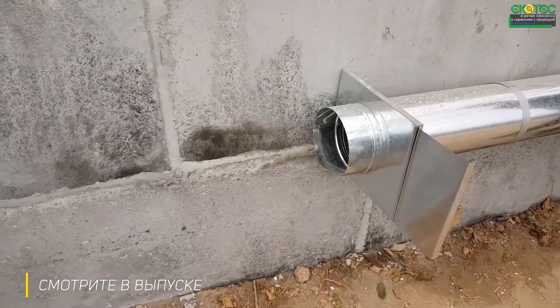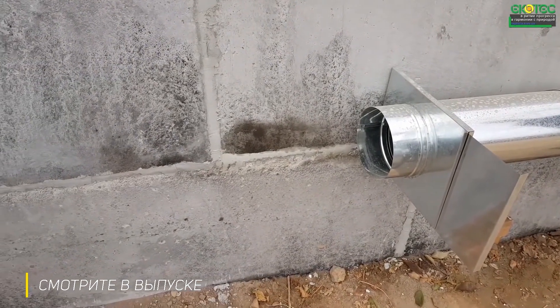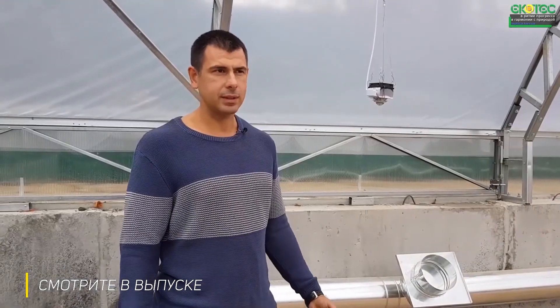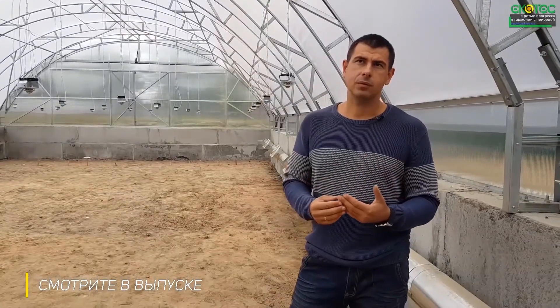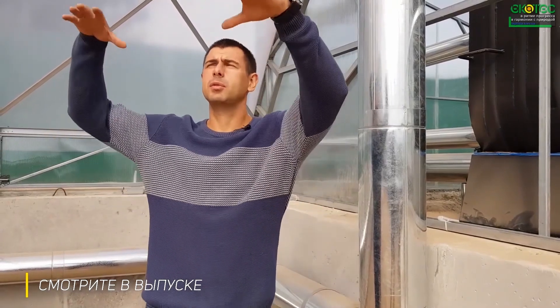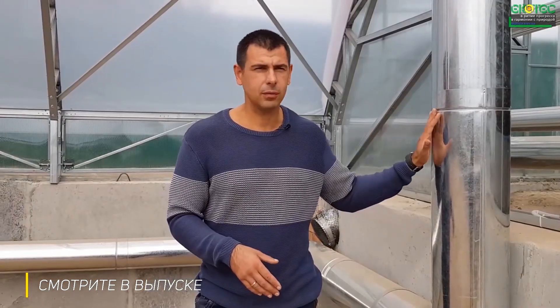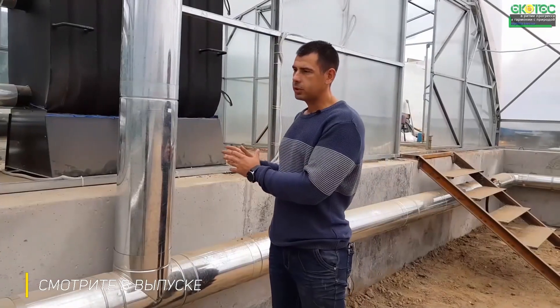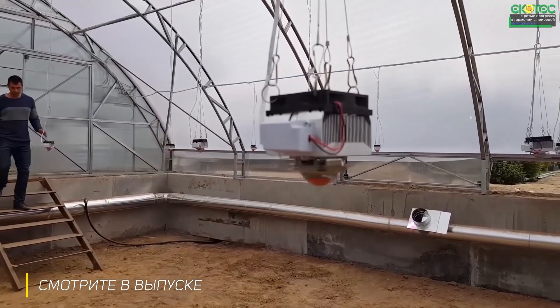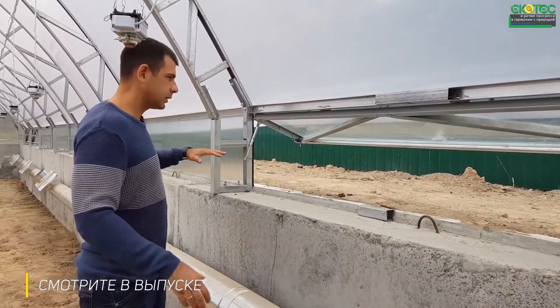Here I put a leaf and you can see how it flies out. It goes down and works with such whirls. And it costs quite a bit of money. We have a boiler that performs the function of air heating — constant air movement, which is very necessary for plants. We heat it here and the heat goes up. It has to heat the air plus 100 degrees. We end up with a high efficiency effect, about 93%. Here's our LED lighting, about 1.2 kilowatts. All around you can open these vents.